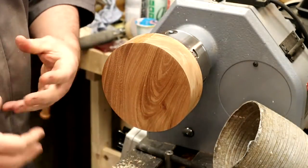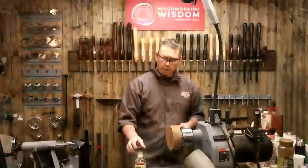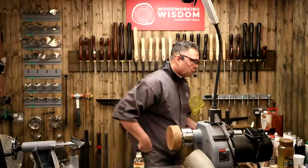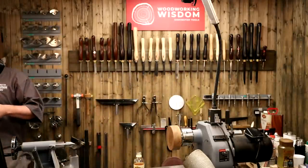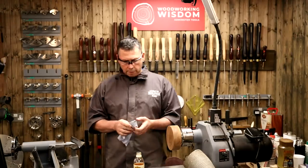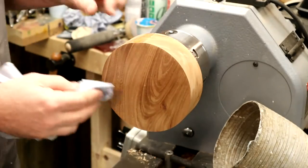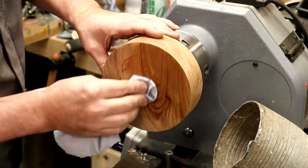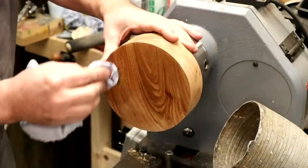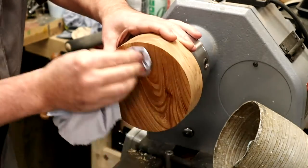Just be a little bit careful when you start going to things like button polish, garnet polishes, all those sorts of things. They're far darker, they're far thicker. The beauty of this one and the brush-on is that they're very liquidy, and for turners it works stunningly well. You have to work it a little bit more, and again, you can apply several coats to make this work, but for me it's one of those really nostalgic smells. That shellac smell is a really beautiful one. It takes me right back to when I started woodworking. You've got to treat it slightly differently to the finishes that we've just used. This doesn't like overworking in terms of applying wet.